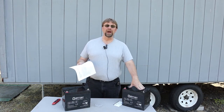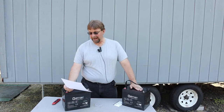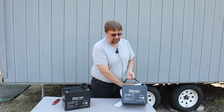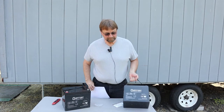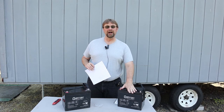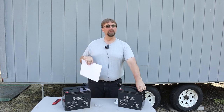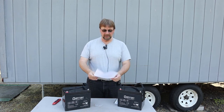You can mount these in any direction. I still only mount them straight up. It's just a habit of mine. But if for some reason, like if you wanted to put it in a kayak where there was limited room, or maybe even a canoe, you could lay it down sideways and slide it underneath like this and have no issues. Don't forget, when you're using a battery like this, to always use some type of terminal fuse or block. You'll see in the description, or you can find on my channel, inline fuses, which the terminal block one is an excellent choice for this when you're using it in a small boat or something like that.